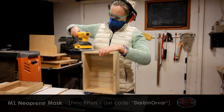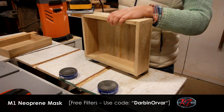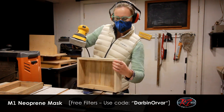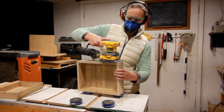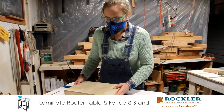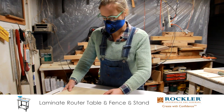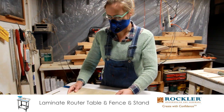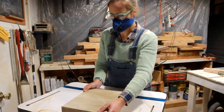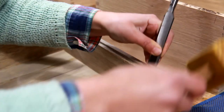I'm doing some sanding. You can see that I used thicker oak — about half an inch or 12 millimeters thick for the bottom box — because I need to do a rabbet on the router so the big box can sit inset, kind of like providing a lid in a sense. I'm using a quarter-inch rabbiting bit going around, and then I cleaned up the edges with a chisel.